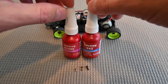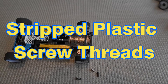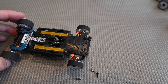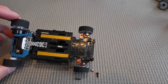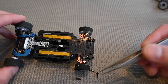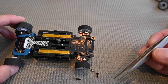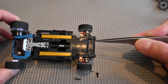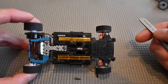Some other problems with screws in plastic: as you use them in and out or over-tighten them, you strip the plastic threads. If you know you're going to take a screw in and out a lot, don't use a plastic tapping screw — use a machine screw with finer threads. The finer threads won't chew into the plastic as much and won't damage it. Areas like the body mount, T-plate, or disc damper which you take in and out frequently are good candidates for machine screws instead of plastic tapping screws.